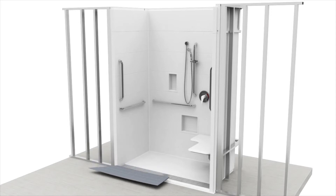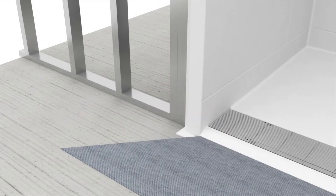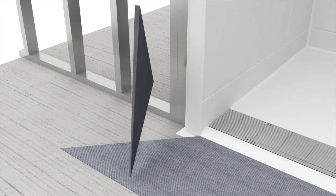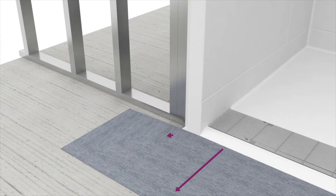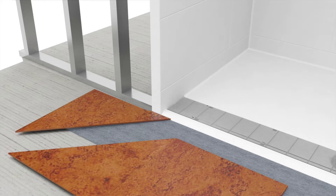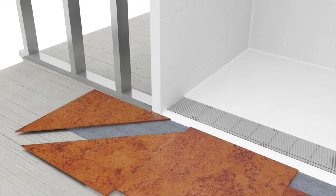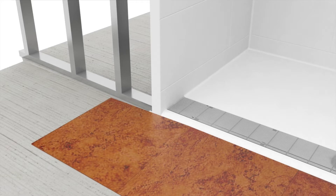When the mat is pulled over the nailing flange, it will sit flush and rest just below the top of the bevel. The sheet vinyl flooring will fill the space. The outer edge of the ramp has a vertical transition that needs to be addressed. The ramp can be cut so that an equal slope segment can be added on each end for gradual slope transition. The vinyl flooring will sit on top of the ramp, fully concealing the ramp below the finished floor. The finished product should leave a smooth transition at the sides and no sharp drops.